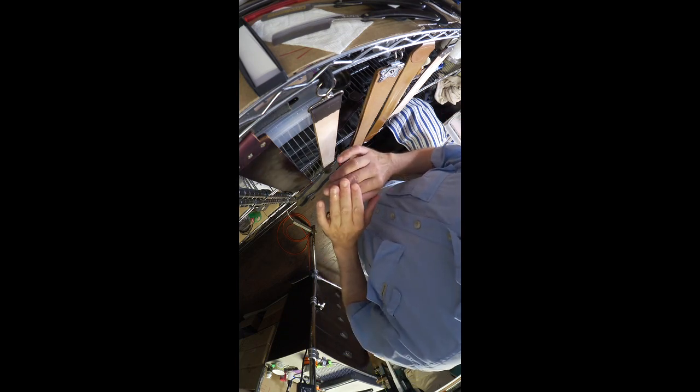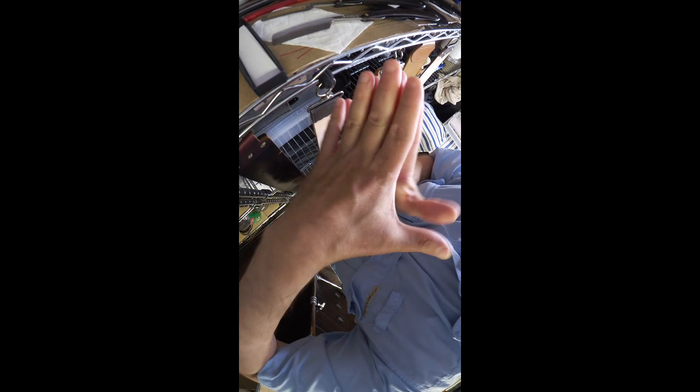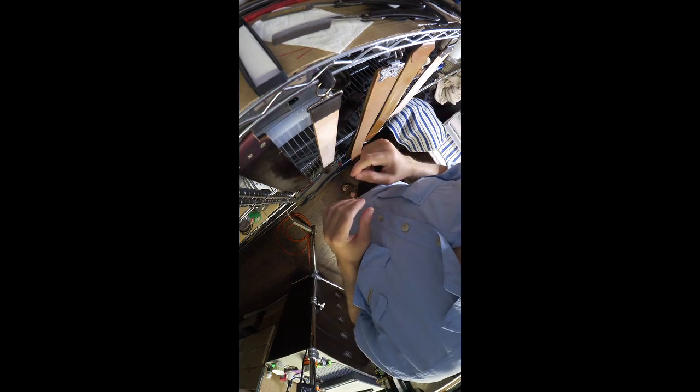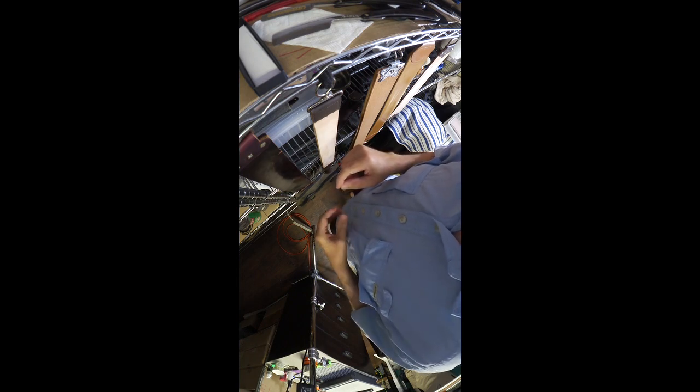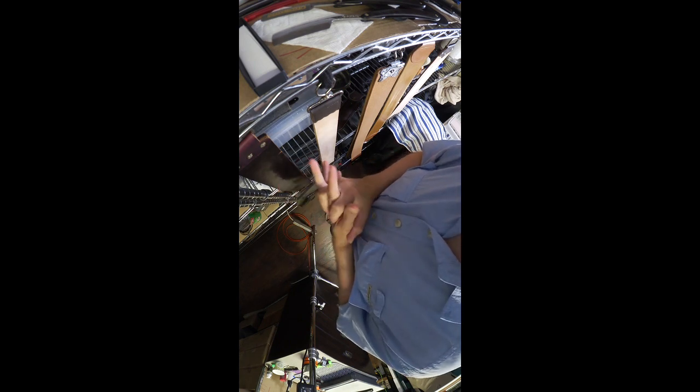Then I switch to a stone shaped to a shape of five meters — this one, which is about two and a quarter millimeters thicker in the middle than the ends. It's a cylinder shape, pretty much flat across this way, and then going down here it's curved to a shape of 17 feet or so. What that does is you made the bevel thinner with your first step, then you're going to hit the front of it because you're using a longer diameter. After you see some wear from that one, you switch to the final stone — in my case, a hard black Arkansas. Any hard, flat, fine finisher you could use if you wish. I prefer to finish on the convex stone for the concave edge all the way through.